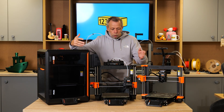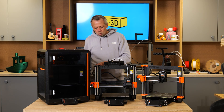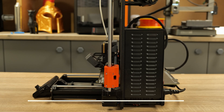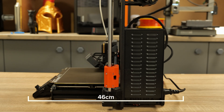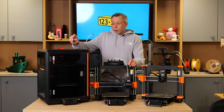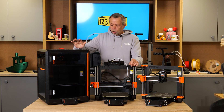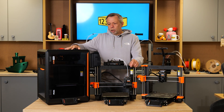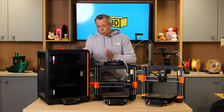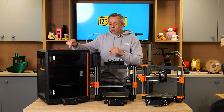The other advantages of the Core 1 over the Mark 4 series is basically the footprint. The Mark 4 and 4S are bedslingers, so you need to allow plenty of room behind the machine for the bed to fully travel backwards and forwards. With the Core 1, being a Core XY, the footprint of the cabinet is all you need. Also, these are fully stackable — in a production environment, you can stack up to six of these machines on top of each other and side by side, and reroute the spool holder to tuck them right up together. They've thought about implementing space-saving ideas with the Core 1 as well.